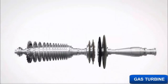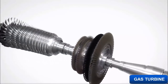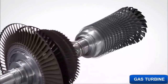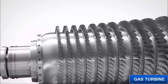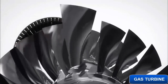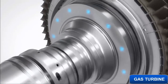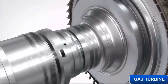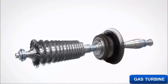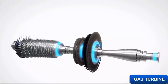The rotors incorporate the heritage of Siemens electron beam welding. The single rigid compressor rotor body ensures reliable, stable, and uniform run-up in hot or cold conditions. Axial blade attachment grooves allow blade replacement without rotor removal. The turbine discs are bolted to the compressor rotor and supported with mineral oil lubricated long-life tilting pad bearings. The balancing planes allow field balancing on-site without disassembly.